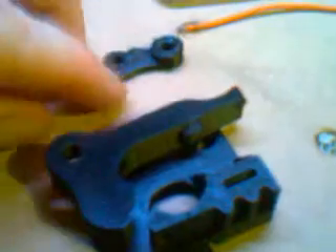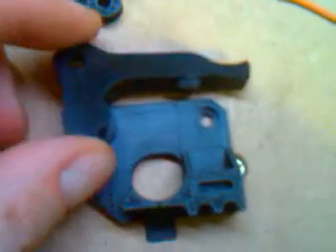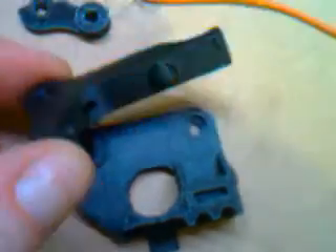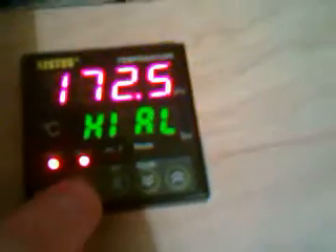Those imperfections can cause the extruder to work a little harder. I've gone ahead and ordered a kit and printed out components — a little spring-loaded setup that goes on the extruder and presses against it with a roller bearing. Apparently that makes the filament travel through a lot better. The spring and bolt set for the extruder upgrade is about $8 per side, so around $16, plus shipping since I'm on the other side of the planet.